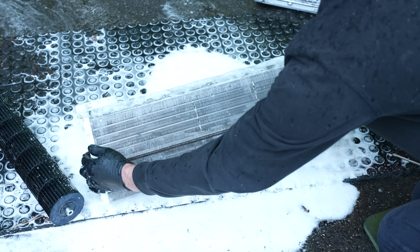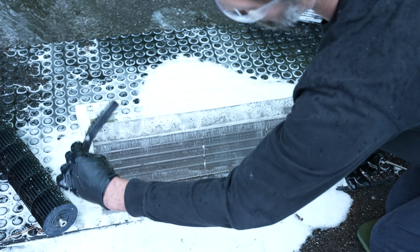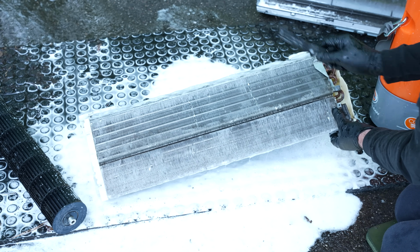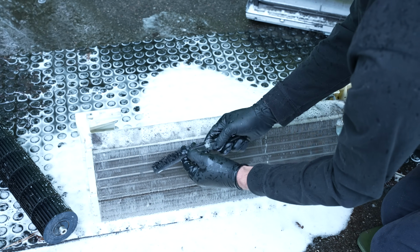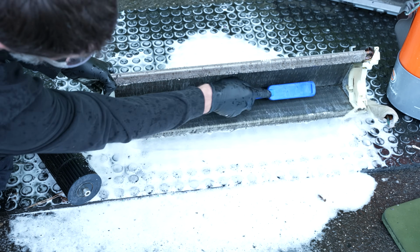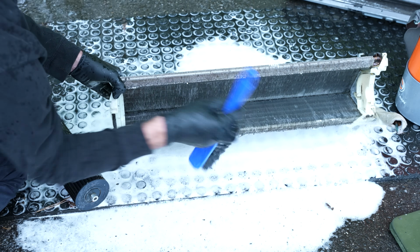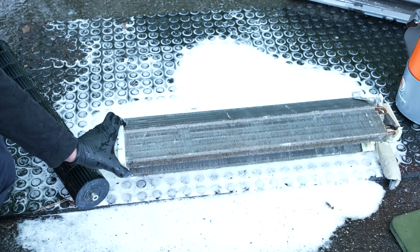So in this video, as we're lifting the coil up, you're going to be getting your arm in there in order to brush it. You could also come up through where the supply was coming at and get a straight brush up in there as well. But I like these little brushes because you can get into a corner with it. And don't get me wrong, sometimes it really is hard to clean something like this. You want to make sure to not bend the fins over. That's a big deal. A lot of times it's in a very, very tight location.